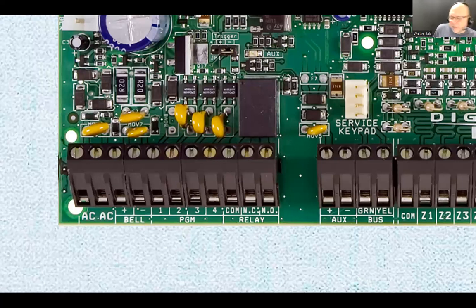And it is designed in a way that it could be connected to something that is commonly called a doorbell transformer. So on one end, it plugs into 120 volt AC. And on the other end of that transformer, there's about 16 to 18 volts AC, so this system is set up so we can use that. Now, those transformers come in basically two versions. One is a plug-in transformer, a box with prongs that you can plug into a regular 120 volt receptacle that most households have in the walls.